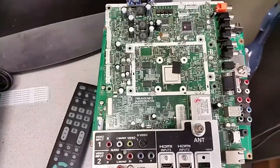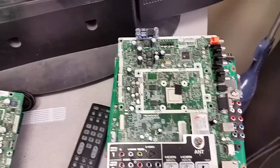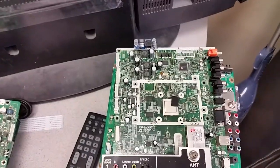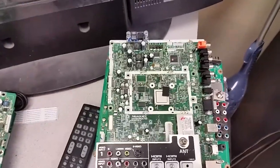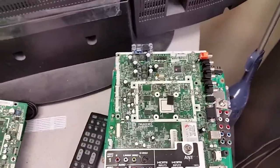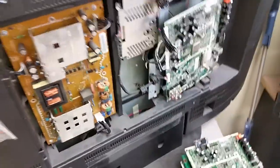So what we did after troubleshooting this, we started suspecting the EEPROM. And what we always tell everybody, and this is a good advice, people keep asking me, I have this and that problem, could it be the EEPROM? Those NAND flash EEPROMs have a number of pages, 1,000, 2,000, 4,000 in the new ones. Any one of them can go bad. And depending on which one it is and how did it go bad, you're going to have a gazillion different problems. And so when in doubt, you don't go by the symptom. In the old linear EEPROMs, you could. With the NAND flash, not so much.